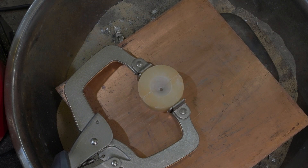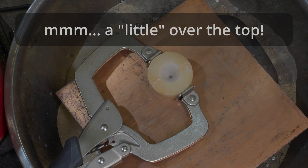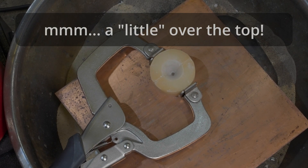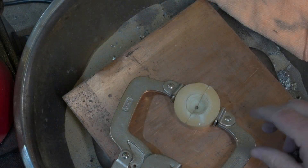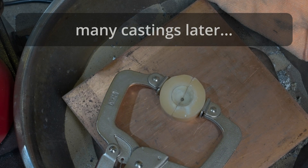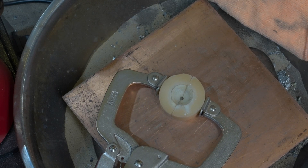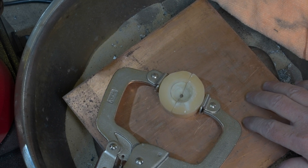Someone came up with this idea — I've put my vibrating tumbler on the bowl so that it'll vibrate, just to see if it's going to help with knocking little air bubbles out and those sorts of things. We're gonna pour pewter at 275, but with mild vibration. Turn vibration on — you can just feel it, just gentle. It's a bit more enthusiastic. We're in the mid-270s.